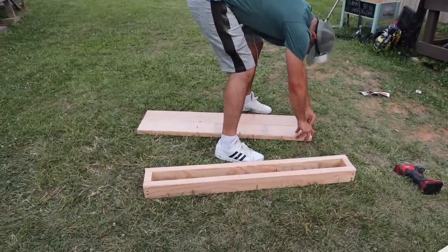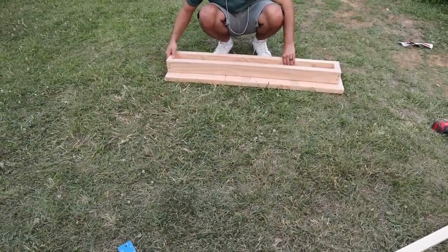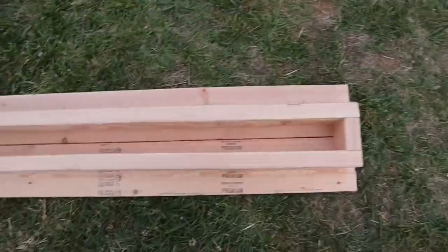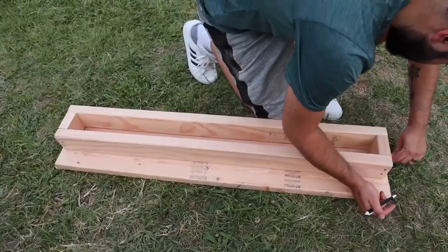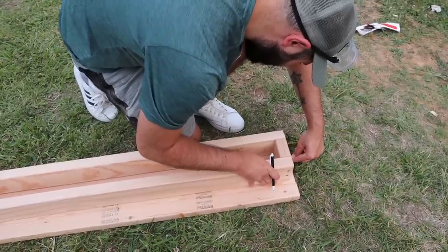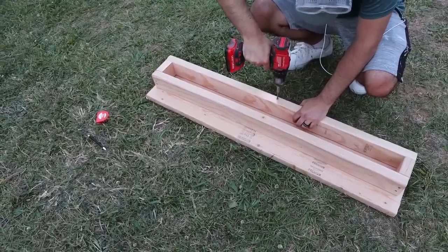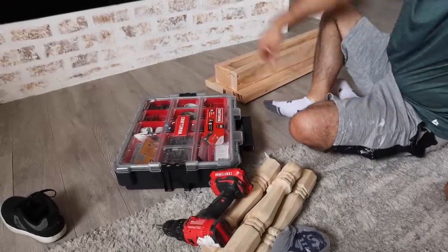These pieces of wood go on top of this frame, and that's what we put half the chevron pattern on. These are attached with screws from the bottom and brad nails from the top. So he attaches the frame from the bottom with long screws and from the top with brad nails. He's making sure there's an even amount of space on both sides because these two boards that we're laying right now underneath the frame, but it'll be on top once we flip it over, that's where the legs are going to go. And we have this little metal piece that we have to attach, and we have to have room for that little metal piece in order to put the legs on.